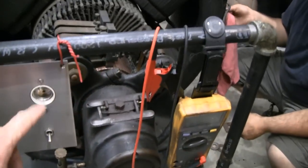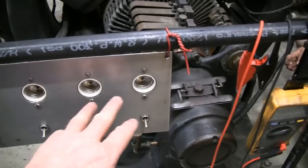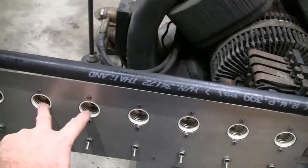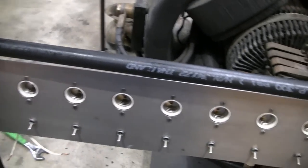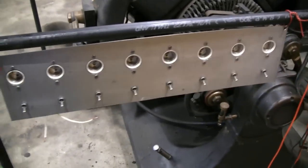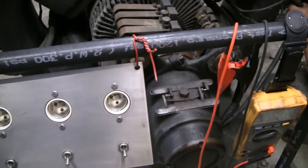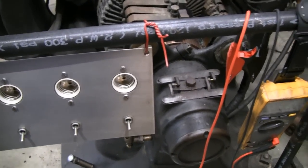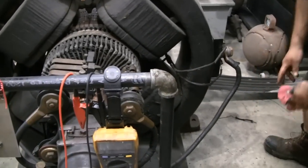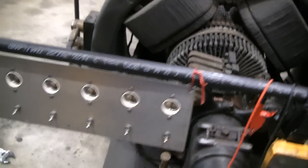What kind of wattage are you talking? I have a couple of 300 watt bulbs, a couple of 200 watt bulbs, and then a couple of 10 watt bulbs. Two 300s, two 200s. I don't know exactly what I brought with me, but it's an assortment. They're going to be pretty bright. Well, it probably won't be, to be honest with you. They provide a resistance. They'll probably glow fairly dimly for the most part. Interesting. But again, it's not to put load on the generator. It's to regulate the output voltage. Oh, okay. I understand what you're saying.